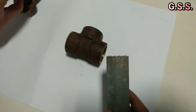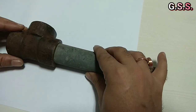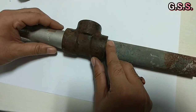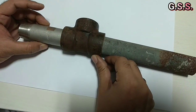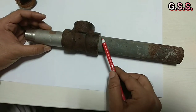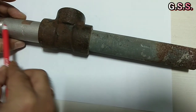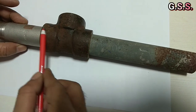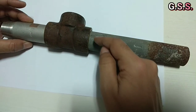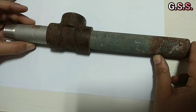On the pipe end, the pipe is fitted into the socket weld groove and a fillet weld is done here. For the other side, similarly, a fillet weld is done as well. The disadvantage of socket weld fittings is that due to this fillet weld, the load flow direction changes — it flows in multiple directions across the fitting. Also, due to this pipe piece, the fillet weld joint cannot be radiographed, which is why the strength of a socket weld joint is not so good.